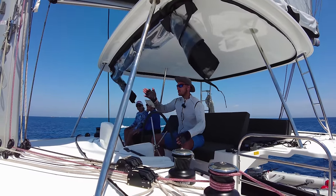So we have started the engines and we put them just in gear. And now we're going to go downwind to 150 apparent wind angle. And we're going to open the Genoa a lot. We're basically going to start downwind sailing.